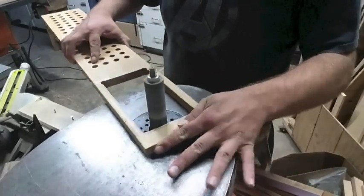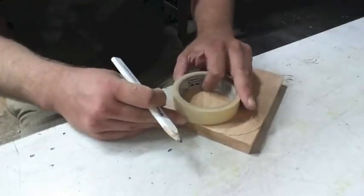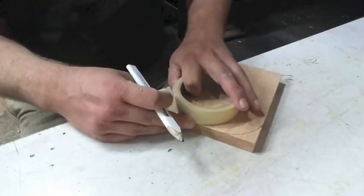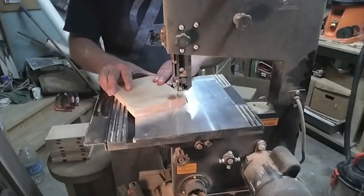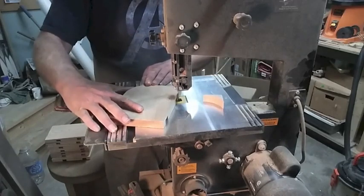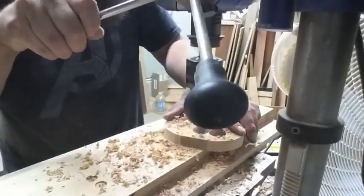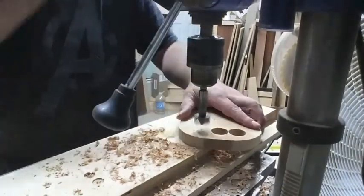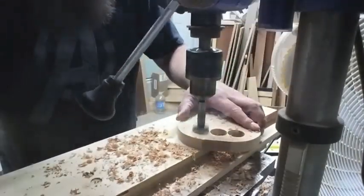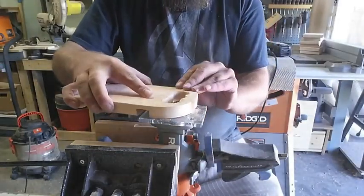Then the jigsaw to cut the big hole out of the end so she can put paint rollers and things in that larger section. A random roll of tape was approximately the right diameter for tracing the rounded parts on the handle sides — chopped those off on the bandsaw. I used a one-inch Forstner bit — maybe three-quarters, I don't remember — for the finger holds.